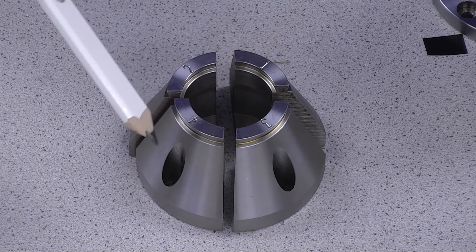One of the great things about the SK-88 is it's available in a 1-1/4 by 8 spindle, which the SK-80 was not. So here I am about to put it on my 1-1/4 inch by 8 spindle American Beauty — it will also work for Powermatic and many other lathes. Even mini lathes now are coming out with 1-1/4 by 8. It has three set screws for reverse turning, uses a drill chuck-type external key, and you can lock it down in three places.